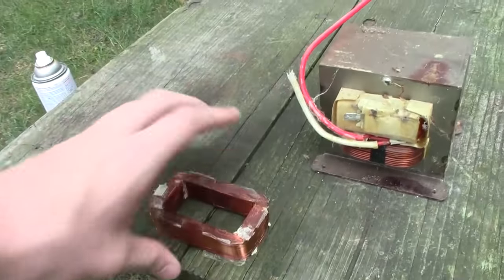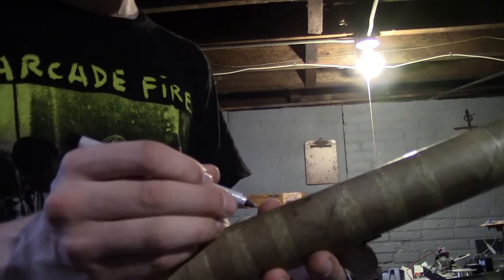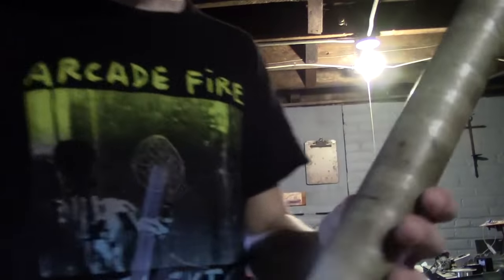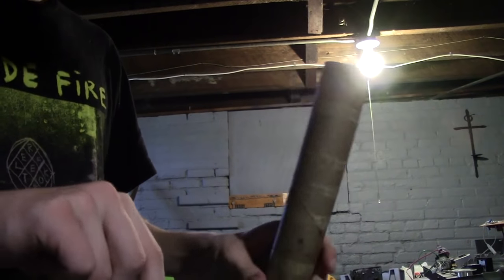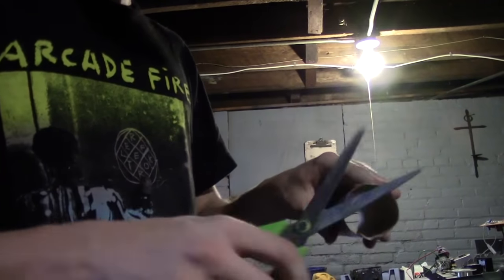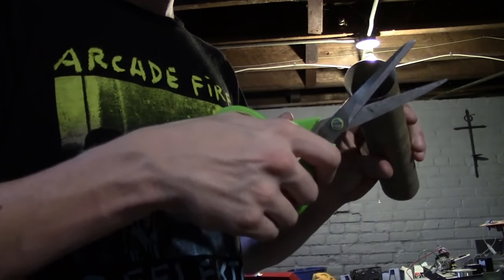Find a source of very thin magnet wire. I'm going to be taking apart a microwave transformer and taking out the secondary coil — you can basically unwind it. It's got a little enamel on it but you'll be able to undo it. Next, measure about eight to ten inches down on the paper towel tube and cut it there, because Tesla coils generally need a length no more than about six times larger than the diameter of the tube. For smaller Tesla coils like this, you need a certain number of turns for the thing to even oscillate, and I found that cutting it about eight to ten inches down is probably the best way to go.